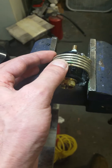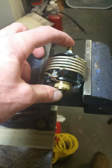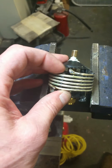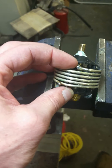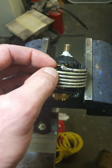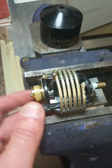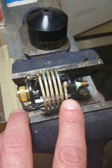It's supposed to have a connection there. But when I was checking the center conductor to the outer part, I was getting no reading at all. I was checking it and this end was completely open — no connection, a broken solder joint. It was an open circuit here, which made me curious why I'd get a reading between these two points but nothing here.